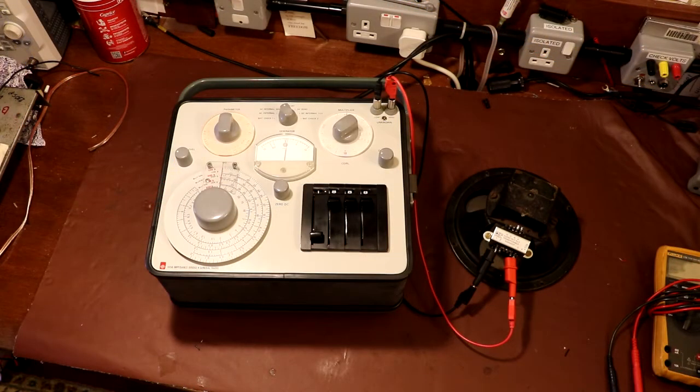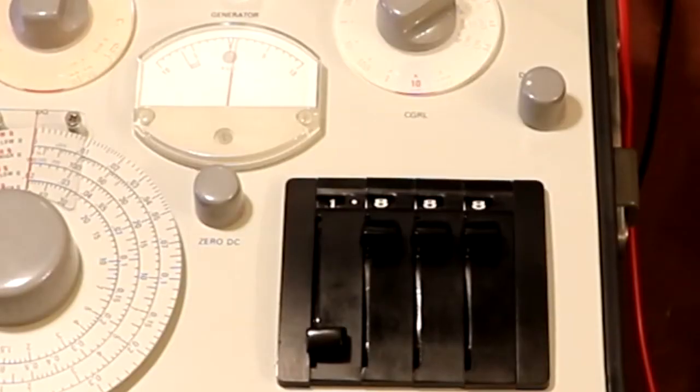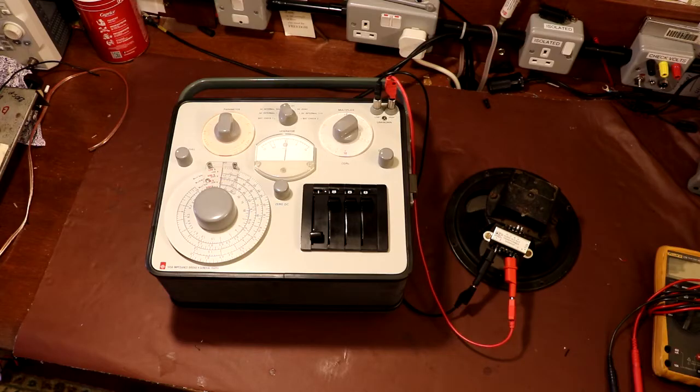So as you saw earlier, I went ahead and I fixed the output transformer to the back of the speaker in a similar way to the original one, and I've also wired the secondary of our transformer to the voice coil of our speaker, and we've connected our output transformer and speaker to our impedance bridge, and it's nulling out at about 18 kilo ohm. I think we said we were gunning for about 17, and to get 18.8, well, that's very close.